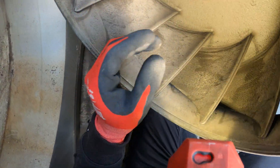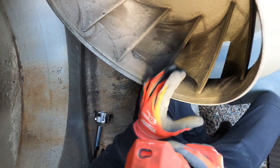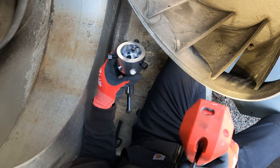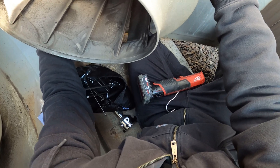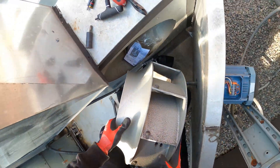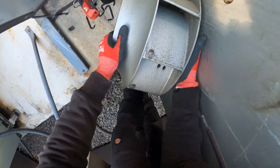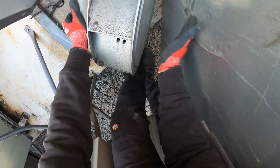I was able to get this door open just enough. The middle piece is our shaft and we got these two little locking nuts, so we're going to loosen this up and try to slide this off. It might not be able to slide off so I got myself a fan puller. I got my Allen key set, just going to loosen that up. I always try to do this by hand first — you might want to put some WD on that shaft. If that wouldn't work I would use that fan puller tool — I'm going to link this in the description, it's awesome and a life saver. I recommend everyone has one in the truck.